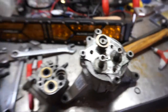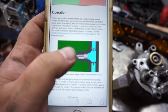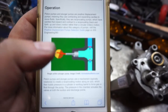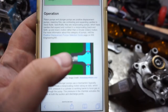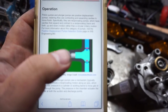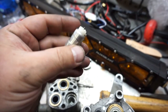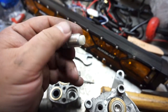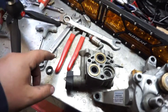You can see right there — sucking the water in, pushing it out; one opens, one closes. Coming back to this thing, I almost wonder if it's a blowout cartridge that's set to go off at a certain pressure, in case the pressure relief valve somehow fails and sends too much pressure back. You don't want to over-pressure your water line.